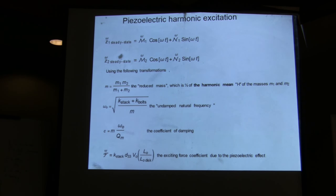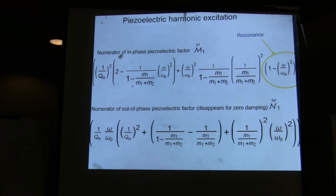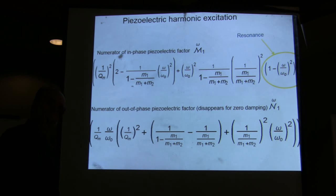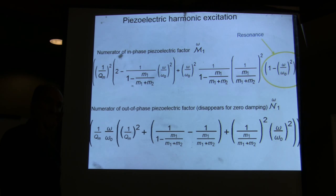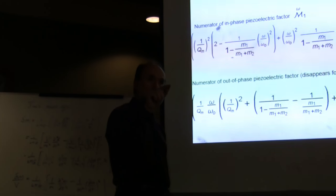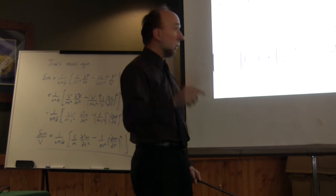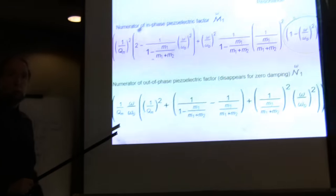Yes? So when you have the whole system together with the bolts, the masses, and the stack, based on what you were saying about the harmonic, does that excitation characteristic change with thermal differences? If you run this thing for a long time and it heats up for 10-15 seconds, how does that change your natural frequency? Yes, and it changes with history. It's an electrical history. It changes due to the fact that it's a very brittle material and you're going to get shear cracks. But all you're doing with the bolts is closing cracks, but you still have a shear motion and you're going to get fatigue. So I'll go over that in detail. There are a lot of things you have to take into account.